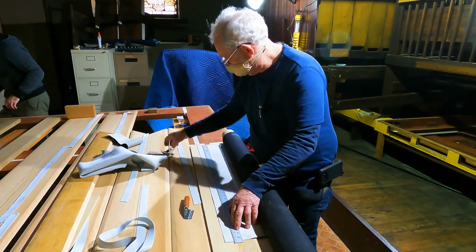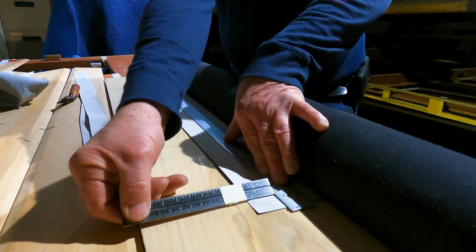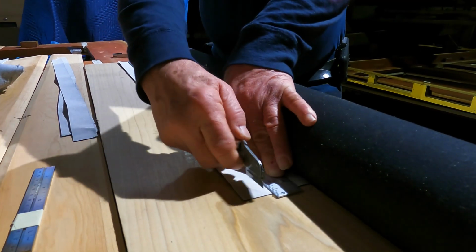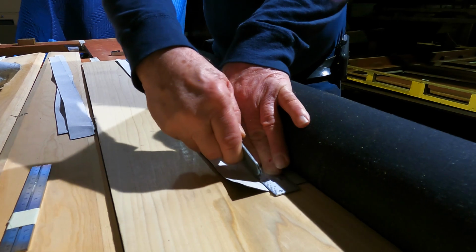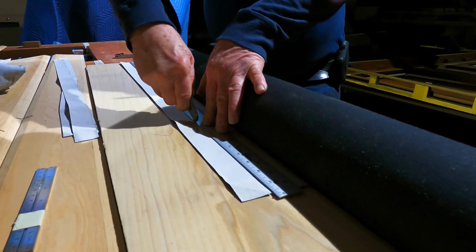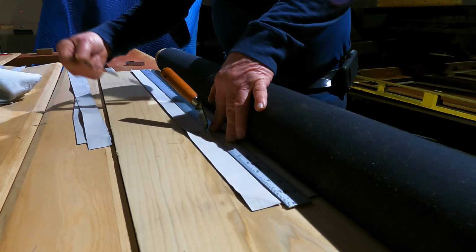The rubber cloth used to attach the ribs to the lid and to the reservoir only needs to be cut into a thin strip. However, those strips have to go all the way around the reservoir twice, once above and once below. All of that material needs to be cut to width by hand for a total amount of material that will attach all 8 ribs.